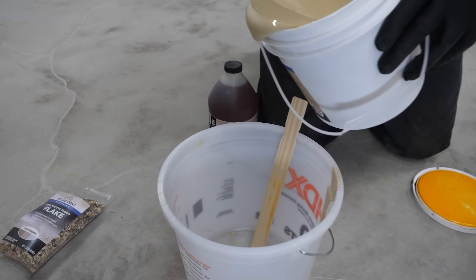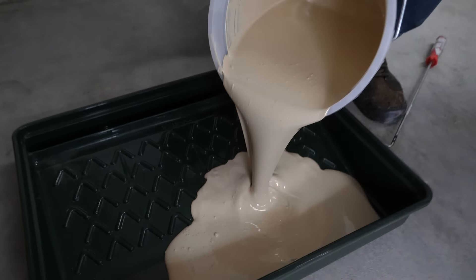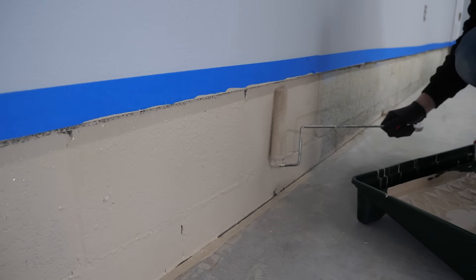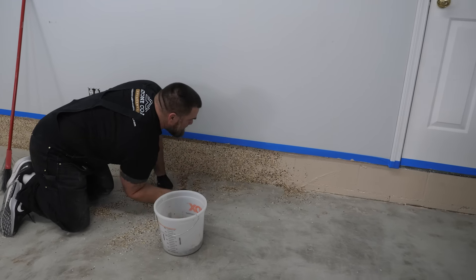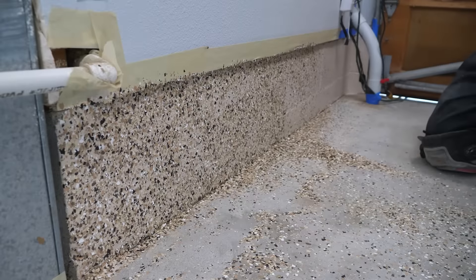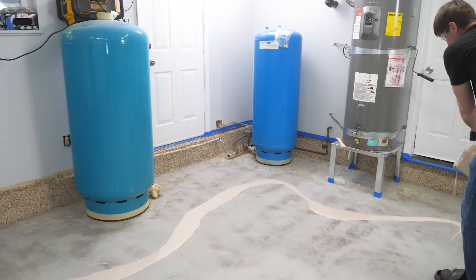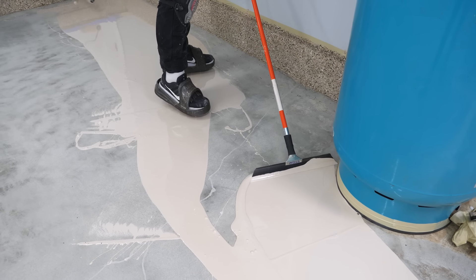The next step is to mix and apply the moisture seal epoxy primer. Measure out one to two ounces per square foot of floor to cover. Thoroughly mix part A before mixing in part B at a two-to-one ratio by volume. Moisture seal epoxy primer has become the industry standard when applying epoxy over concrete — it penetrates in like tree roots, creating a tenacious bond into the slab. Mix material for two to four minutes with a paint stick or a drill and paddle mixer, scraping the sides and bottom midway through. Once mixed, spread the epoxy primer across the floor in thin lines with a magic trowel squeegee, then use a quarter-inch microfiber roller to roll over it twice — front to back, then side to side. We're looking for a nice, thin coat here — thin to win. Keep the material from pooling up in deep puddles.